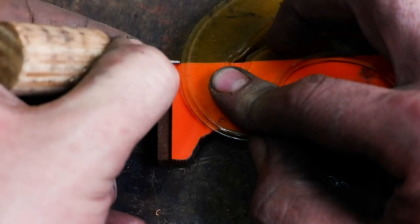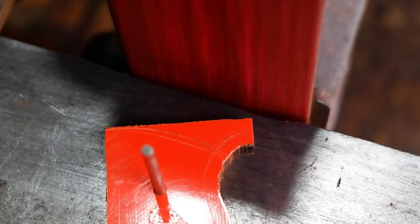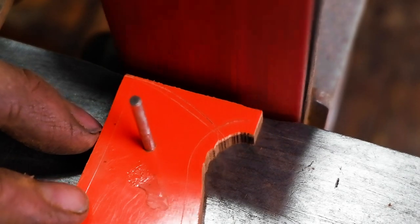Also mark the front shape of your handle material and grind to shape as needed. Taper the scales if needed and slightly countersink the lanyard tube hole so that we can flare the tube out later.